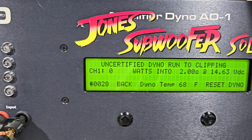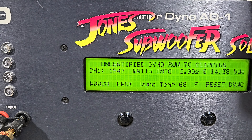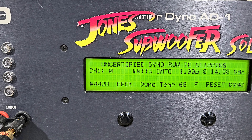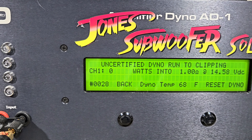Here we are on the dyno with the NVX NDA105. It's rated 780 watts at 4 ohms, 1,300 watts at 2 ohms, and 2,000 watts at 1 ohm — all rated at 1% THD, which matches our certified testing that runs up to 1% distortion or clipping. Uncertified testing keeps reading even with distortion or clipping present. We'll finish with a dynamic burst test using a 40 Hz pulse tone.